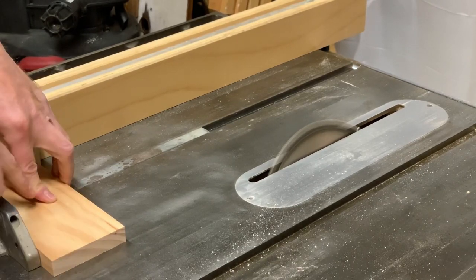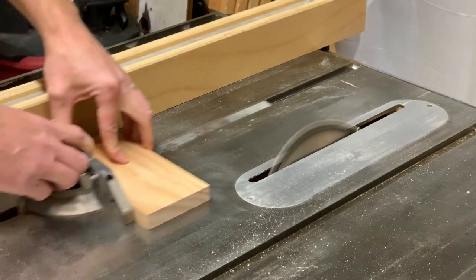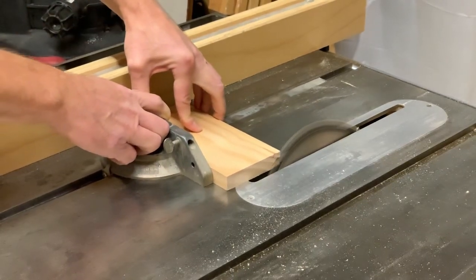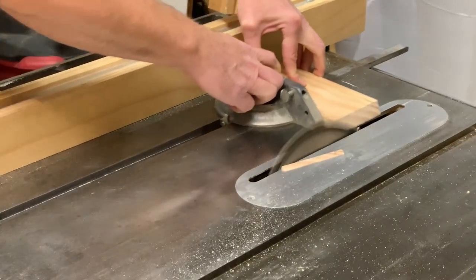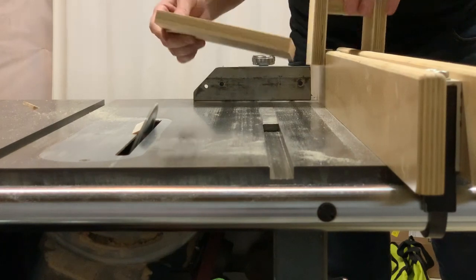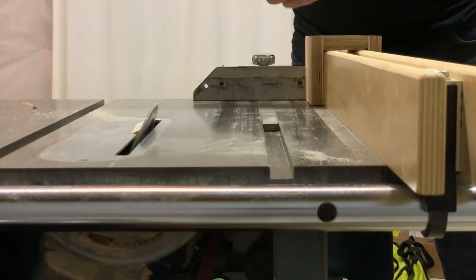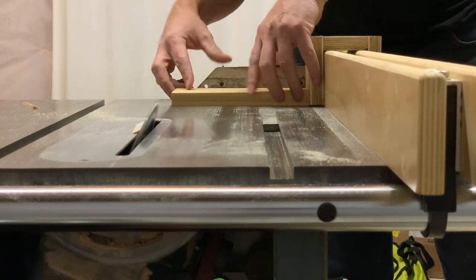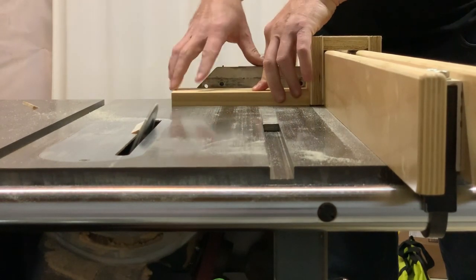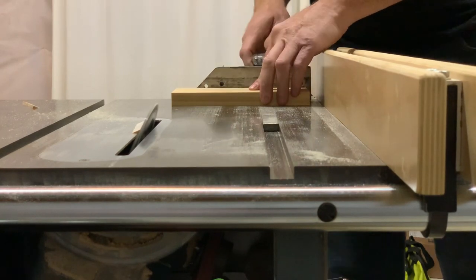In order to keep the length of the sides I just cut, I tried to position the rip fence so that it would cut the miter exactly to the corner of the piece without shortening it. You'll also see that I have an additional spacer that I was referencing the pieces against, but I removed it before doing the cut. This is table saw safety 101 — kickback is bad. If I run the piece directly along the rip fence, it wouldn't take much for the piece to get kinked slightly and caught by the saw blade, sending it flying on a path of destruction. I used the additional spacer to help me position the piece, then took it away so that there was a space between the blade and the rip fence.